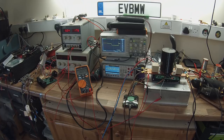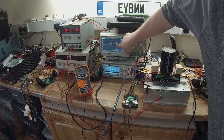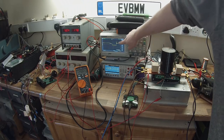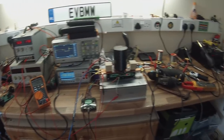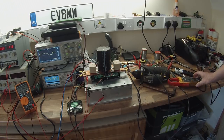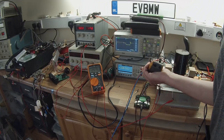Let's go a little more. Let's go to 30%. See? Magnitude of our turn-off spike is now actually exceeding the bus voltage. See this? So there's now the equivalent of 60 volts being experienced by the transistor DC bus. Our starter is warming up lovely here now. You can actually smell the starter. 41.8 amps, 8.5 volts. Battery is still holding 29.8 volts. Battery current is now 18.5 amps.